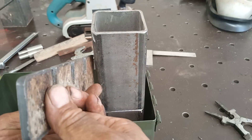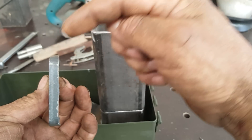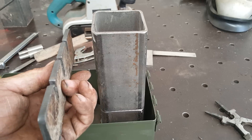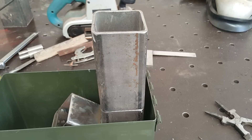I know my kerf width and the width of the metal, but what's on paper doesn't always relate to the steel. When the plasma cutter cuts — if you know what you're looking for — this side is higher than this side. It doesn't cut a perfectly 90 degrees; it actually tapers. That's just the nature of the beast. So you want a quarter-inch wide hole, but with that taper in there you've got to account for it or take a grinder in there and try to grind that out. I'll probably take it down to about 300 thousandths and see if we can't tighten that up a little bit.